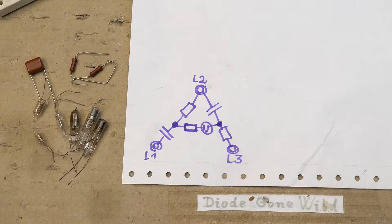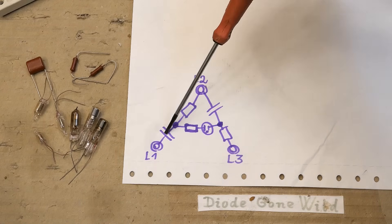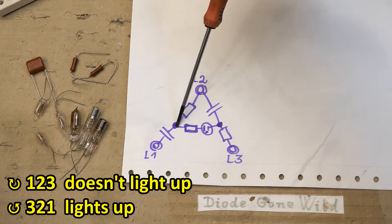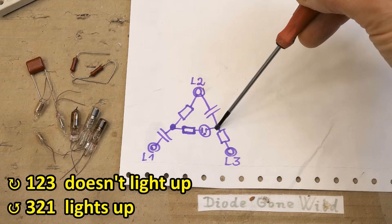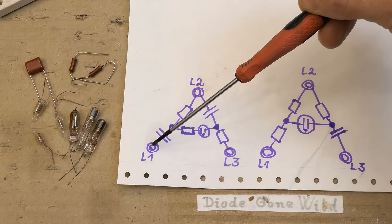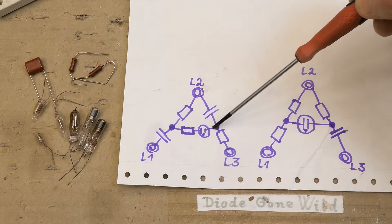This is one well-known phase sequence indicator using a neon lamp. It uses two RC circuits — basically two series combinations of a capacitor and resistor acting as phase shifters. The neon lamp lights up in one direction and not the other, because in one direction the voltage between the two center points basically cancels out to almost zero. In the other direction the voltage is significant and the lamp lights up. There's an even simpler version using one fewer capacitor — one resistive divider and one phase shifter. Because the divider side is made of just resistors, no additional resistor in series with the lamp is needed; without it, a direct path through capacitors would make the neon lamp run in sudden pulses.